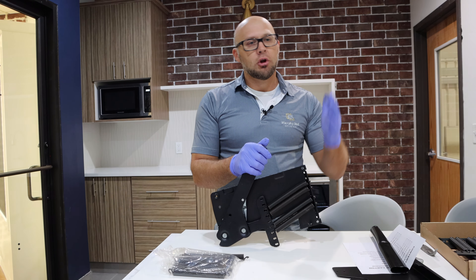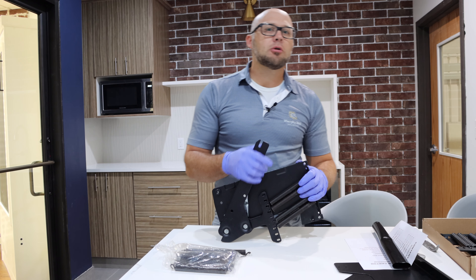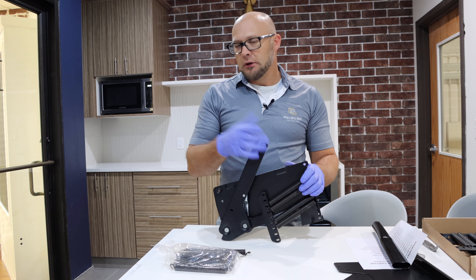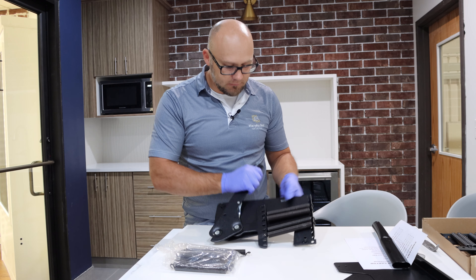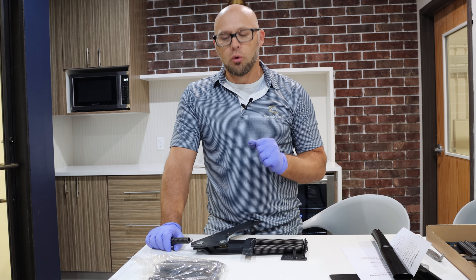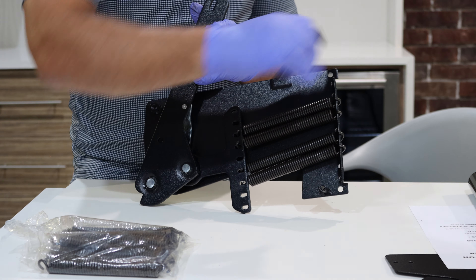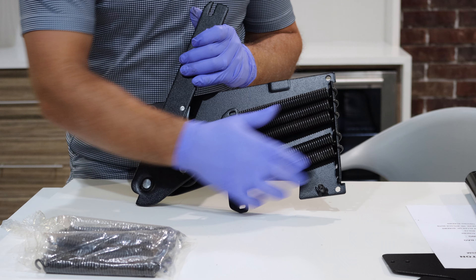When you've installed your bed frame and the legs are coming up a little bit off the floor, it means you have too many springs in there because that tension is pulling the bed off the floor. You need to remove the bed frame out of the mechanism — that's covered in my separate videos. Once it's loose, this is where you come in and remove a spring. If you want fine tuning where you just need a little bit more tension, add the springs on the bottom of the mechanism because those give you a little less tension than adding them on top. If you have a really heavy mattress, load up most of the top springs first and then add a few more on the bottom.